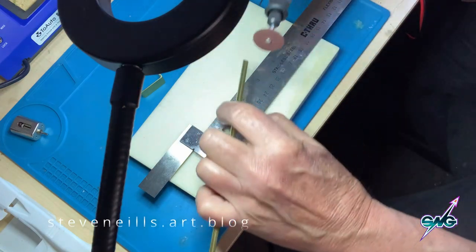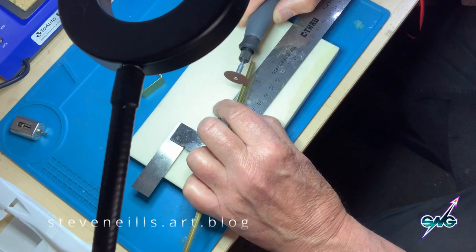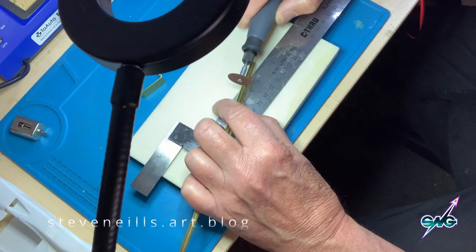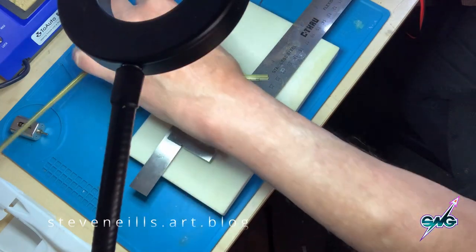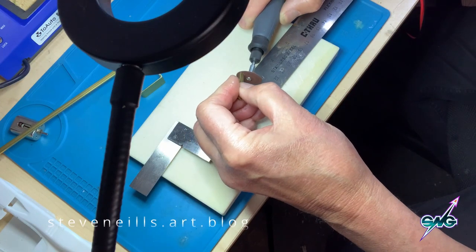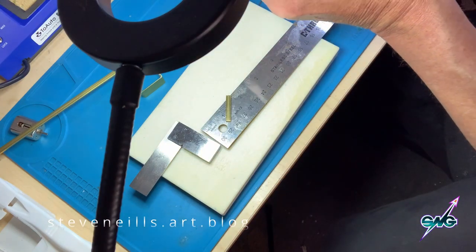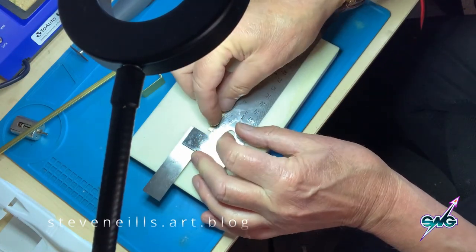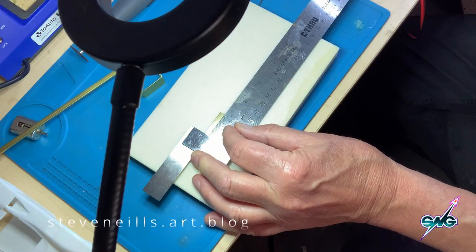Now I'm going to cut this with this 409. I'm going to cut towards the outside line, and I don't think I did a good job on that. We'll see. I may have. And you can see how easy it was for me to control. So, I'm going to check it. And it is exactly 1 1/16. So I did pretty good. That's the first time I've used that tool to do that. I'm very pleased at how well those 409 Dremel discs really work to cut that.